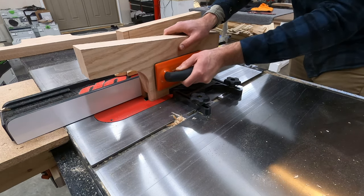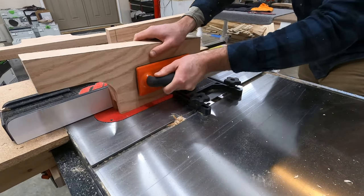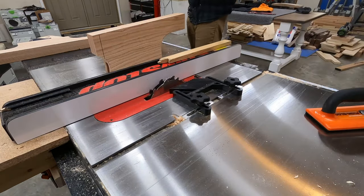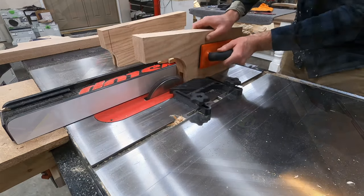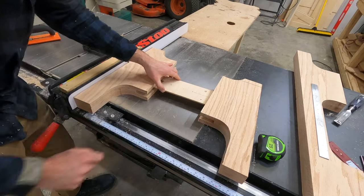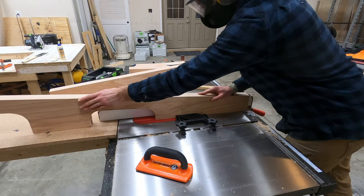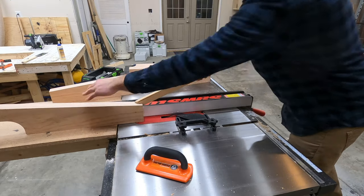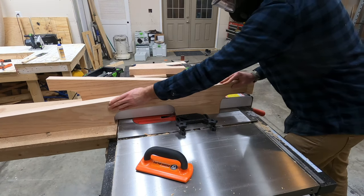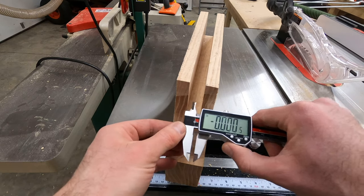To get around that problem, I cut a three-quarter inch dado groove right down the exact center of each leg piece, taking multiple very small passes and cranking the blade up a little bit each time — maybe 10 or 12 cuts altogether. If you use a dado blade in this manner, take off just a little material at each pass, which will give you a nice groove that the interior panel can slide down into, held in place by loose dowel joinery we'll get to later. The same groove is cut in the larger legs for the headboard end of the bed, and by taking it slow with shallow cuts I felt pretty comfortable making this cut overall.